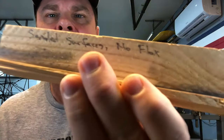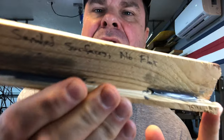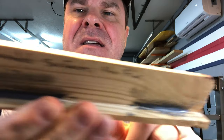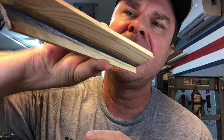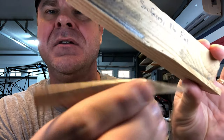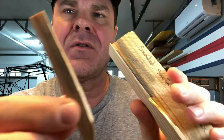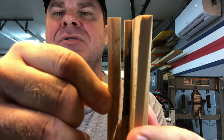Basically, I think I figured it out. Definitely, this is just Hysol. I changed to a plastic cup. Smoother. I did two strips, not the whole line. I did actually the whole line on the other side. But again, this worked out very consistently. Looks really good. Tried angular force on it, and it was very strong. All that broke was the shim itself.